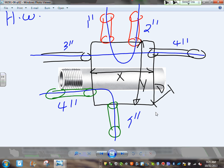Now, Adam, when you do a problem like this, here's how you handle it. First, ignore everything else and do the calculation for a straight pull. Then, ignore everything else and do the calculation for an angle pull. Then, ignore everything else and do the U pull. And then choose the one that gives you the largest calculation. So you do them one at a time.